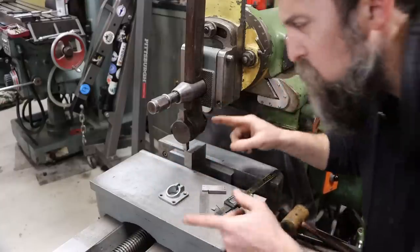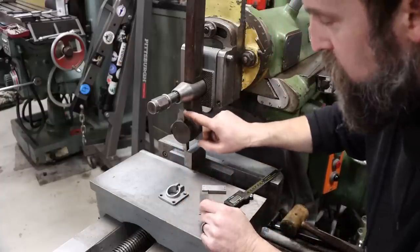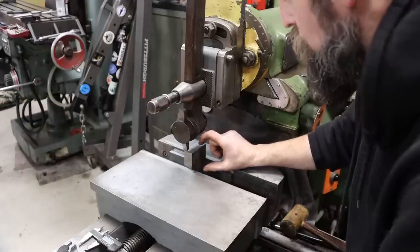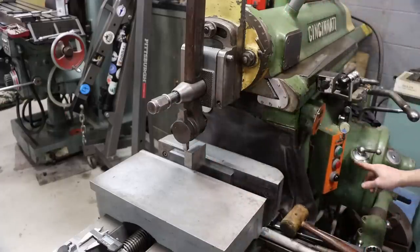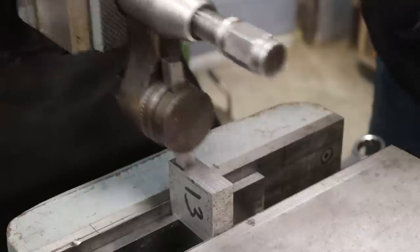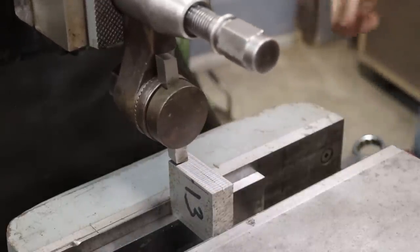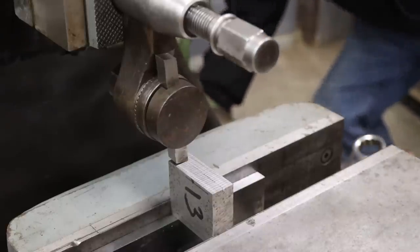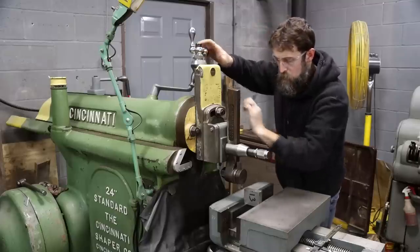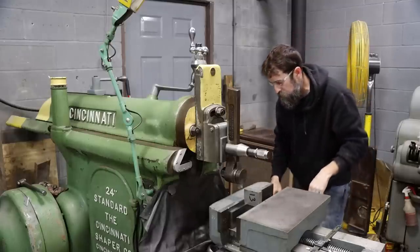We're using our Williams number 42 universal holder, which is absolutely amazing and hard to find. For a shaper, for a planer, they're awesome. With a piece of half inch Rex 95, I believe, high speed steel. So let's work down the width. Yep, work down the width and we'll do the rest of the operations. Slow this thing down just a little bit. That's more like it. Took 20 thousandths, and we'll do 20 thousandths step over, just to clean this thing up.